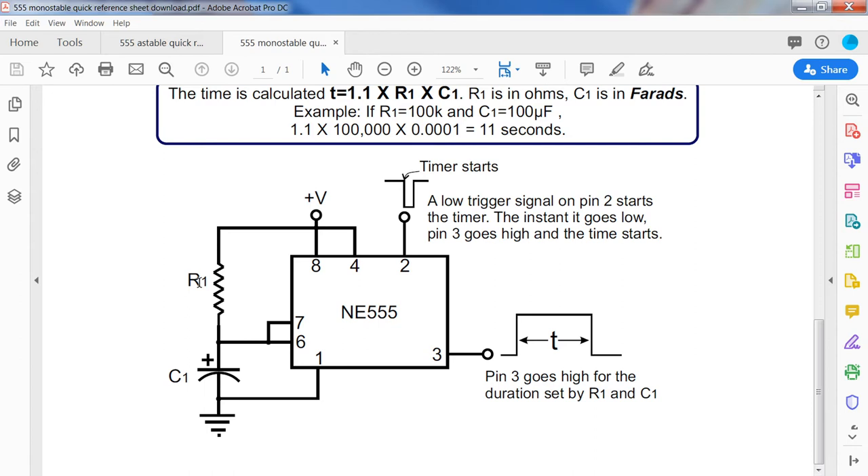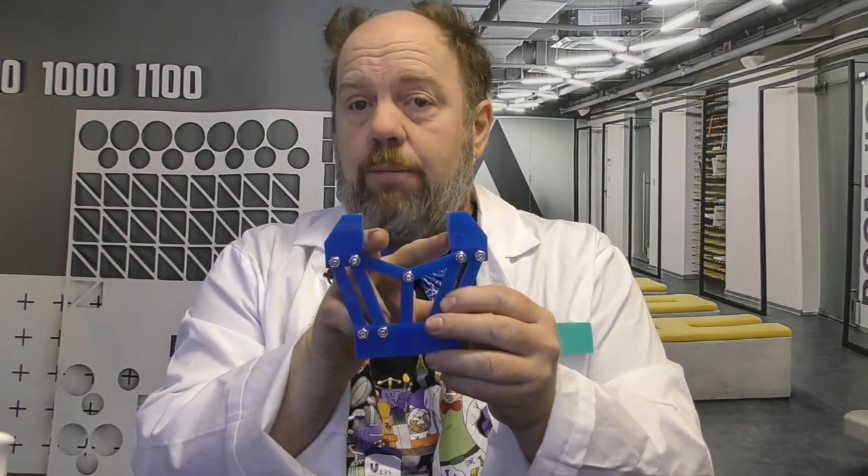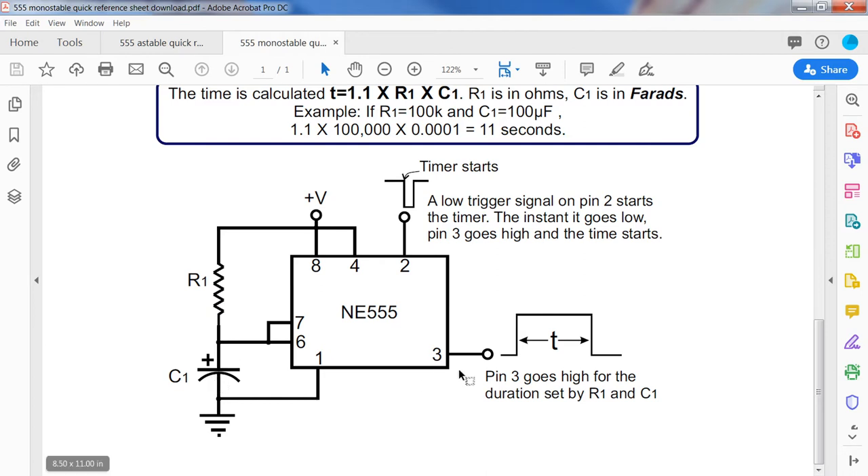By varying the pot, I can change the pulse width according to demand, and the capacitive pressure sensor changes the capacitance according to pressure on the fingertip, which will also change the pulse width some more. You would have to have your servo drive direction set up so that the 2 ms pulse width opens the gripper and removes pressure from the fingertip. In this way, the capacitor and resistor try to fight each other to balance the frequency and get just the right amount of pressure that you have set using the pot.